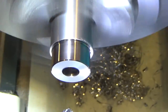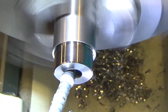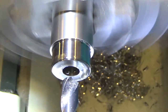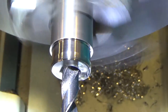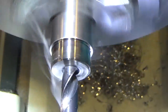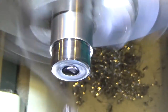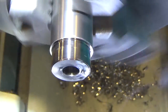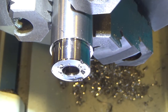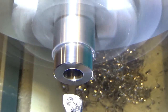So once I get to the larger size drill bits, I have no choice. I have to use lube because it's so hard to cut that the drill bit catches and sticks and then spins in the chuck. Well, that's better. All right, I'd say that's probably mandatory then. Can you see the drill bit smoking? Yeah. Stuff is hot. Okay, so we're going to bore the inside out.